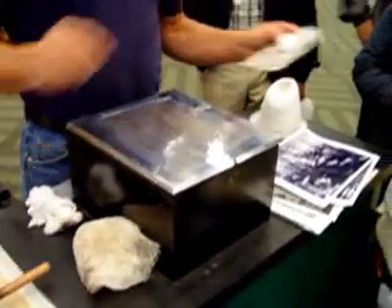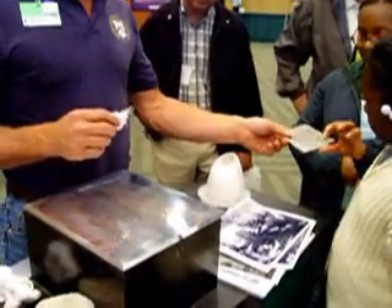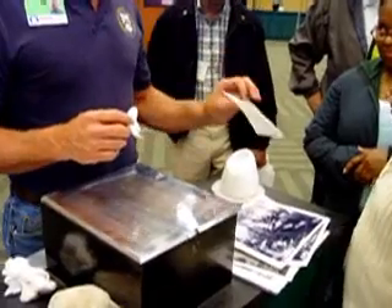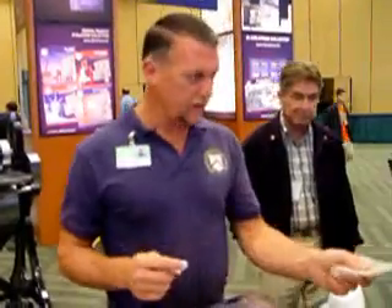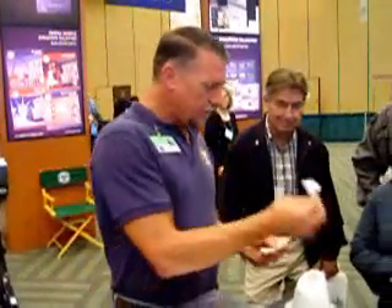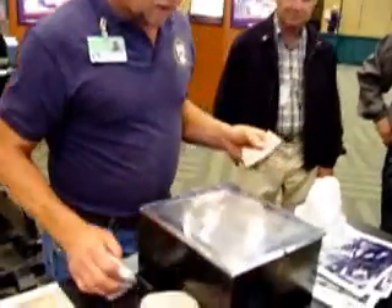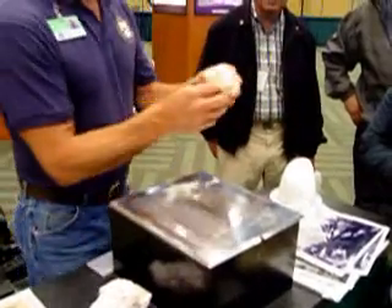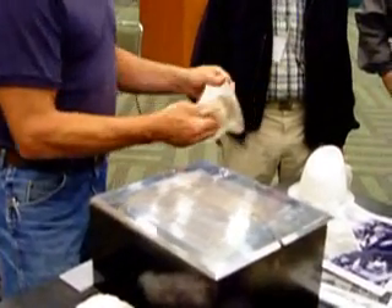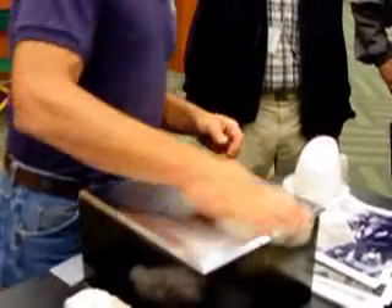We're going to take a piece of what they call crinoline. We need it for wedding dresses, hoop skirts, panty coats, Halloween costumes, and prom dresses. It's real stiff — see how stiff that is? If it wasn't, we couldn't use cheesecloth to do this, because that's real soft and would wipe the ink right out of the engraving. Being nice and stiff, it lets me ride right across the top of the plate and get up the excess ink without taking it out of the engraving.